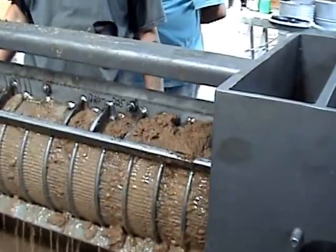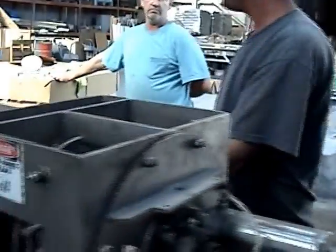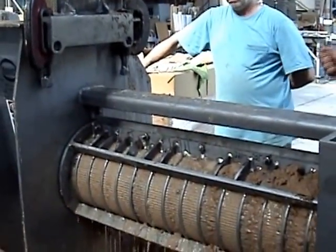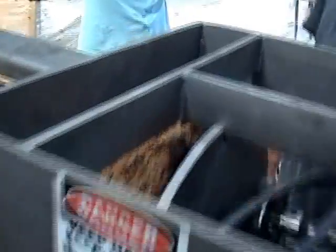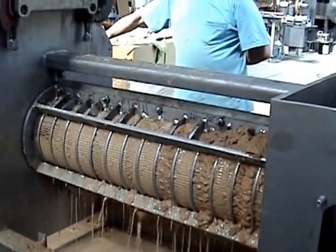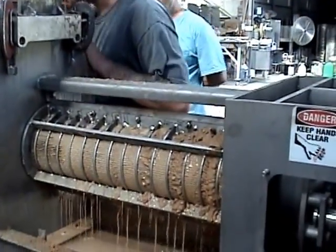Let me correct those numbers on that test. The test was longer than I thought. It was 55 pounds an hour of pressed cake and 330 pounds per hour of pressed liquor — grand total 385 pounds an hour in a press that should be doing a lot more than that. Both screens are now about the same slot width. The third variable besides the taper of the screw and the RPM is the pressure on the discharge cone. I'm at bare minimum, so instead of cutting from 60 PSI down to 20, I had to double the speed of the screw.